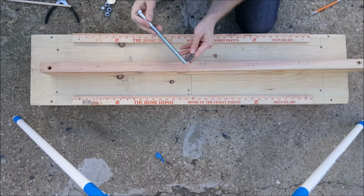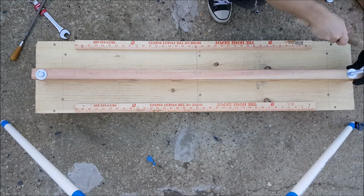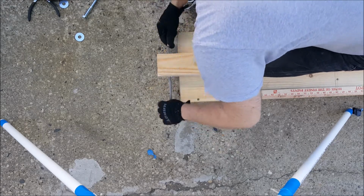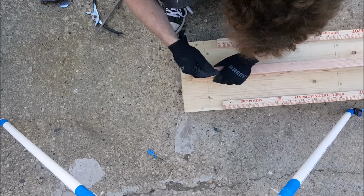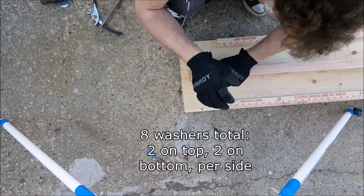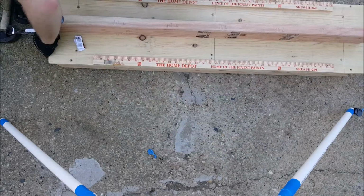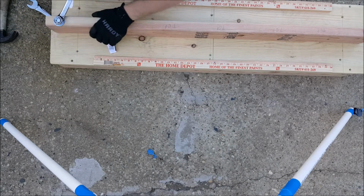Now we can assemble our bolt, and as I was saying, if it's difficult to get in, just use a rat tail file to widen out the hole in your beam, and then try it again. Slide everything on. Don't forget the washers. I only have one here, but I switched to two later on just so it was nice and strong. My washers originally kind of coned out, but after I upped it to two 1/16 inch washers, there was no problems whatsoever. Screw everything together, and you're going to use those two wrenches to tighten and loosen them once you put a board in.